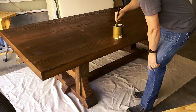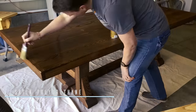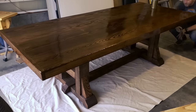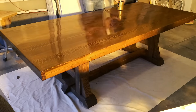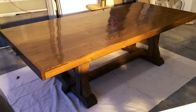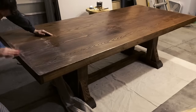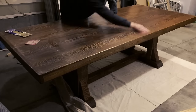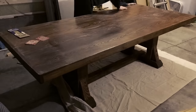With the stain applied, I was ready to finish this table. I chose to finish with a Minwax Satin or Matte Polyurethane finish to give it kind of a soft look, not too glossy. Make sure to use tack cloth to wipe all the dust off the table before you get started with the finish since any imperfections could certainly show up. I used a high-end brush here — not a cheap one like I used with the stain — but one with nice bristles to make sure I got a nice smooth even application. I put the first coat on pretty heavy, let it dry, and then sanded it with some 320 grit. The reason we use a higher grit like 220, 320, or even 400 in between coats is that you don't want to scratch the finish, but you do want to remove the little bumps or imperfections that can show up while drying. Be sure to sand between each coat and then use tack cloth again to get it nice and cleaned up.